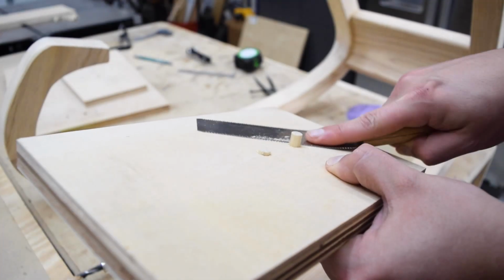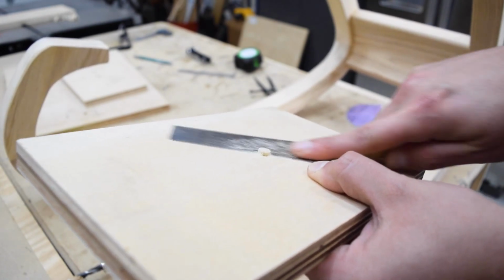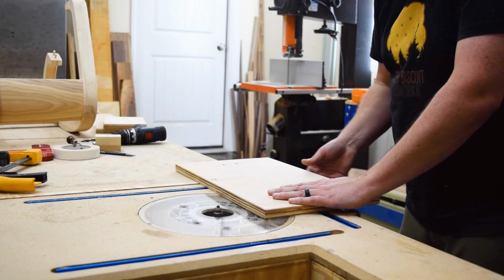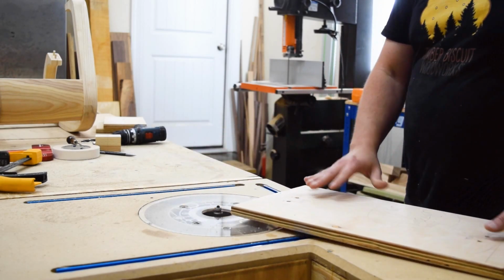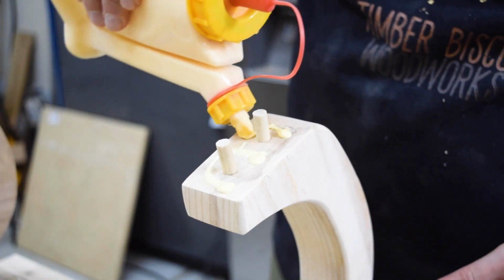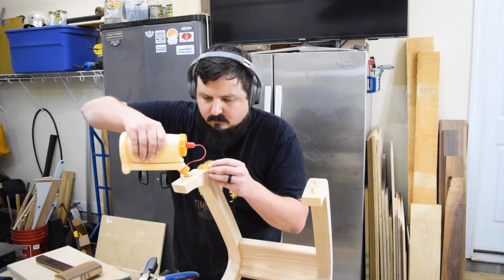With the pieces fitting like a glove, I used a flush trim saw to cut the dowels down before giving the plywood edges a 1/8 inch round over. Gluing the seats and leg rests was pretty straightforward. However, I did have to use a spring clamp to have enough room for good clamping pressure, so check that your clamps fit before going all in.